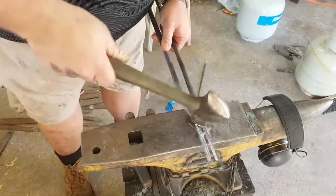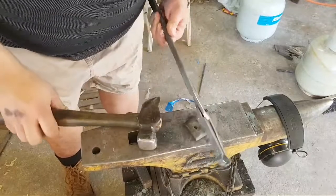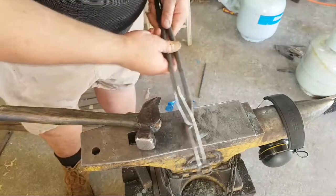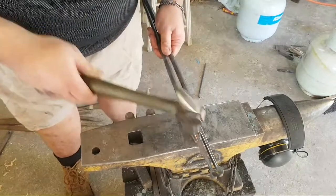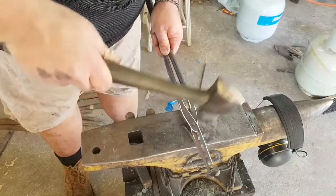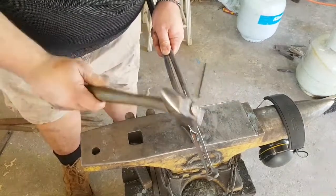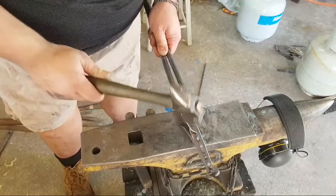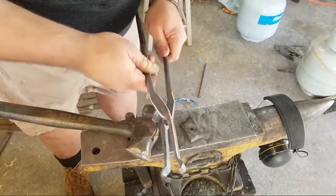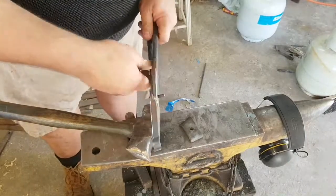But if you tap around the corners, it flares out the material, and that means that it won't come out through the hole. That's why we've got a 10mm rather than a 6mm. You don't want to use that for your bolster stock. Yeah, so now it's flared. You can't get them apart, and it'll hold them in place.